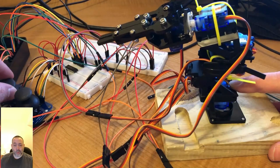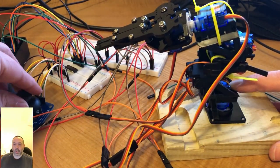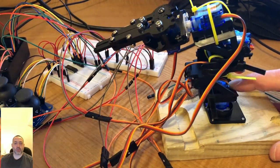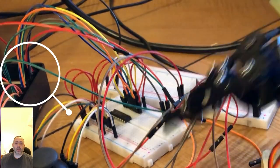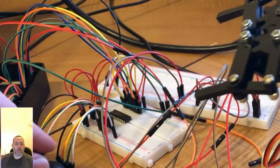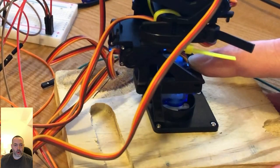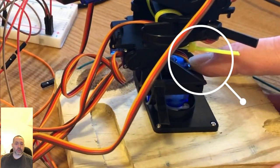The first version was just a robot gripper arm. I hooked it up to some micro servos, tilt pan, and zip ties — pretty bare bones, and a lot of the parts I wasn't using as they were originally made for, so there was a lot of customization involved. I hooked it up directly to the Raspberry Pi and stitched together some code using examples I found online. The parts work pretty well for their size, but since they're not heavy duty they're pretty lightweight and not meant to hold the weight of that gripper arm, so you can see it kind of droops a little bit. I had to support the base with my finger in the video.